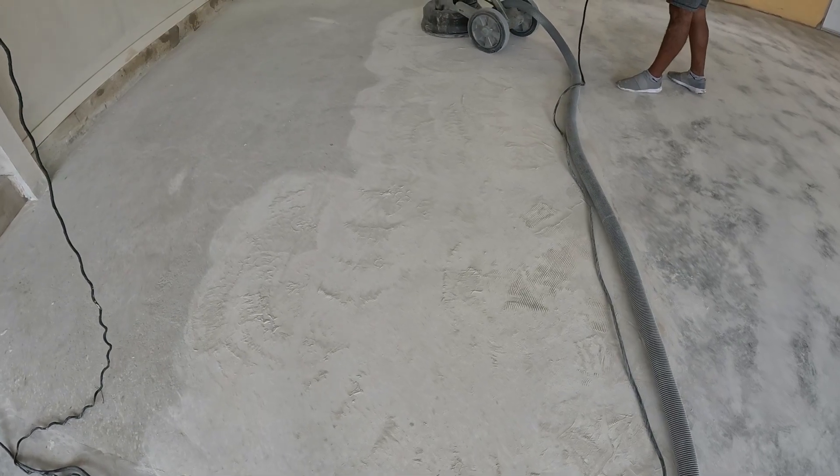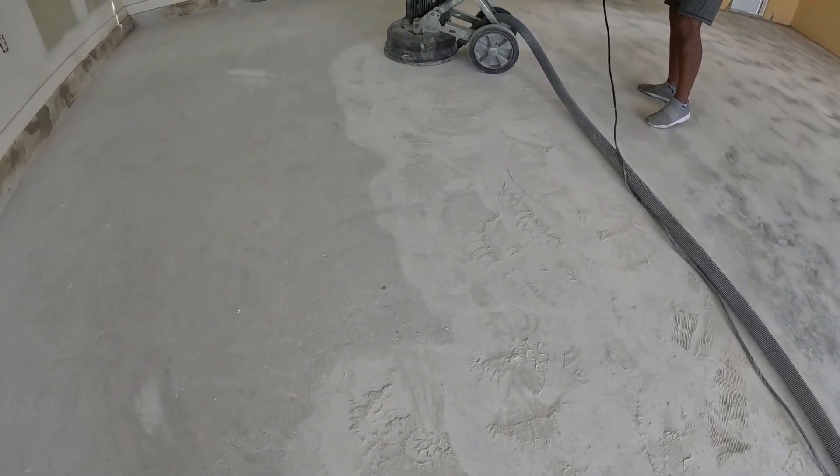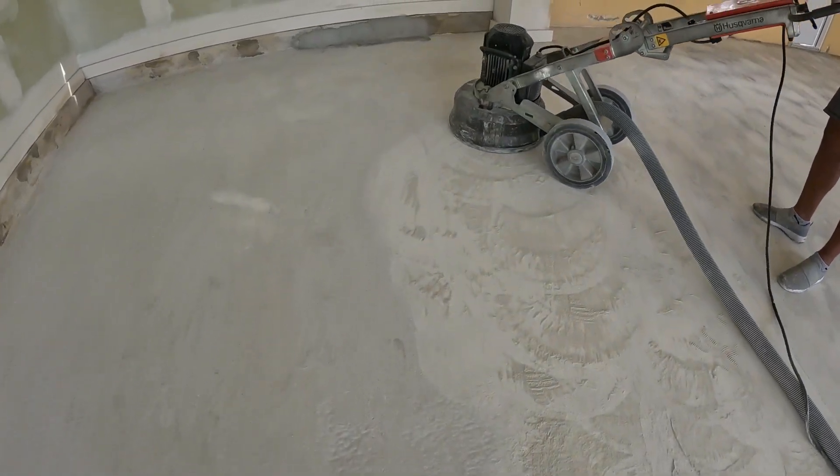If you were to paint right over the sealed surface, it would peel off as soon as you pull hot tires from your vehicle on it. So a lot of time was spent sanding it down nice and slow, making sure all the surface was powdered up and dusty. Those sand scratches — similar to painting a car — are what enable the epoxy or primer to stick and integrate into the surface rather than just sitting on top.